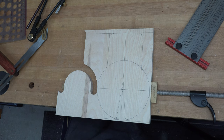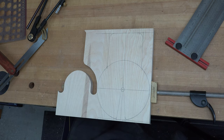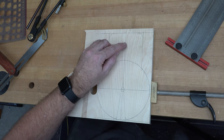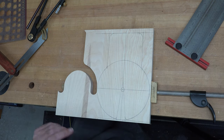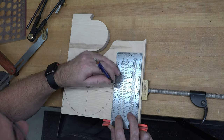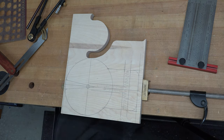Now that we have this done, it's time to cut a few dados. We need a dado that is the same thickness as our ply — one right across the back edge about one inch in from the end, and another one right here that is going to support a gusset for the table. There's the mark for our dado right here, and this will be our other dado coming on the underside of our table.